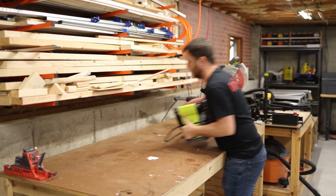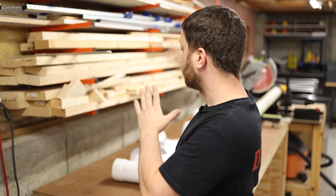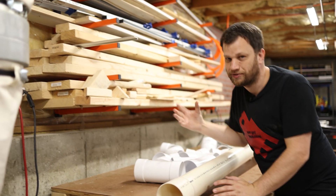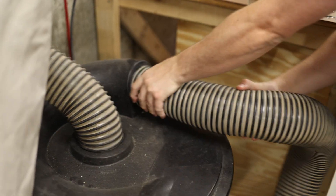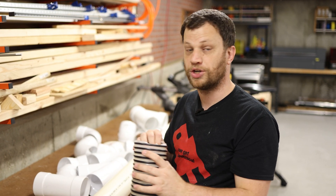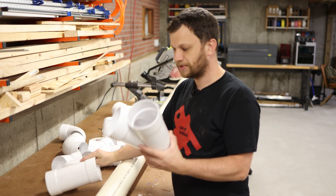So step one is to get some PVC pipe up and create my three sawdust stations. One of my stations is going to be at the table saw while the rest of the dust collection system will move along the wall. I've got a little gap below this lumber rack that's perfect for this dust collection pipe — it's wasted space so I'm going to tuck it up underneath there. I'm probably just going to remove this existing flexible pipe. Do you see these ridges on the flexible hose? Those actually reduce your suction power from your dust collector, so I'm going to use as much rigid pipe as possible. First I need to decide what kind of Y splitter I want to use — I've got a couple of different options.